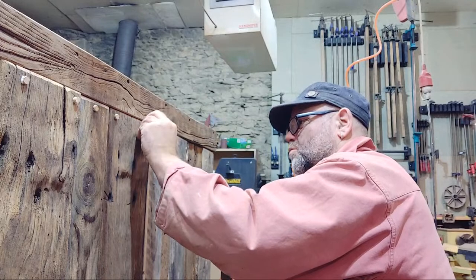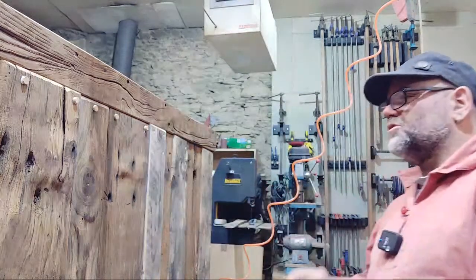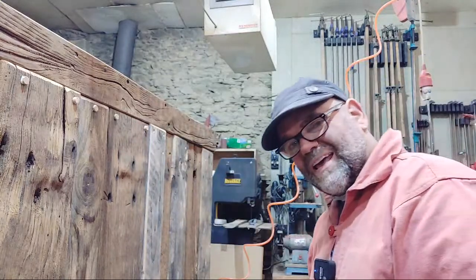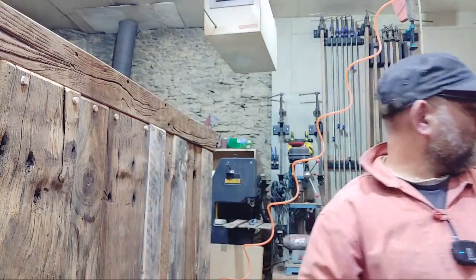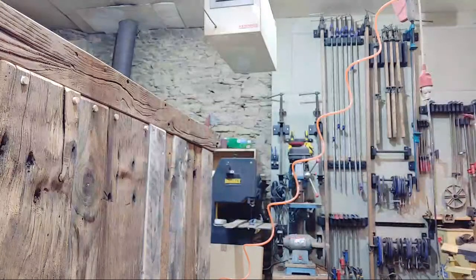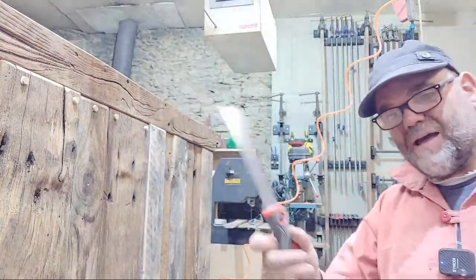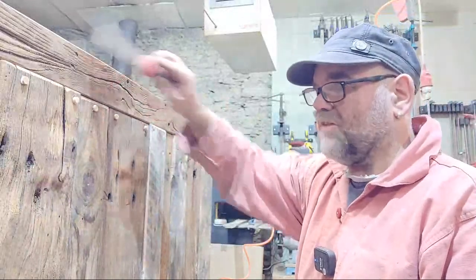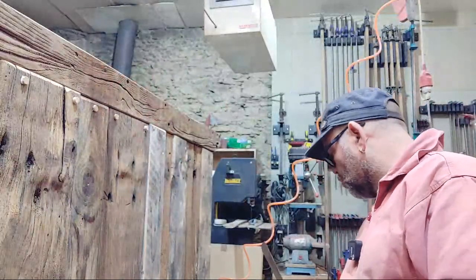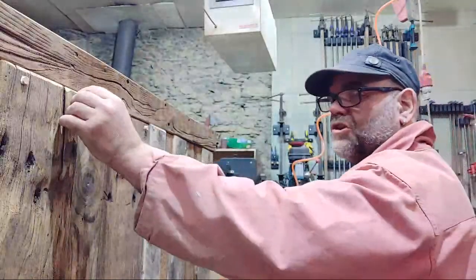Now, I won't be cutting these off just yet. I said there's two ways to cut these off. The other one is using a little pull saw, a little flush pull saw. They work well. So I've got one there somewhere. Let me show you. Well then, this is a little Lidl's one that's crap. But it's all right for this job though. It's actually just like you can chop off like that. Other than that, use a chisel or a sander. I'll just use a chisel because I want to make it look tight.